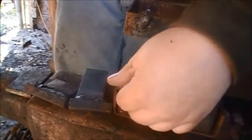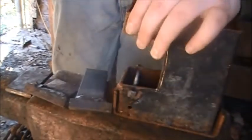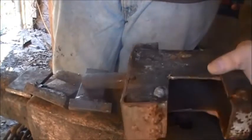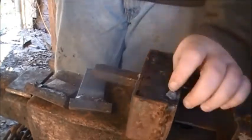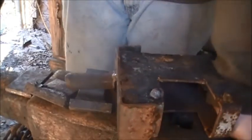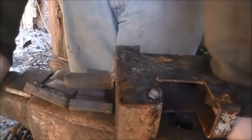These are just bolts that are in place, so you could just drill the holes, run them through, tighten them in with nuts. For the bottom piece, you could just get another piece of sheet metal — it doesn't have to be really thick because the anvil is supporting it. This is just there to keep things from falling out of the bottom. You could fold it up to the shape and screw or rivet it in place.